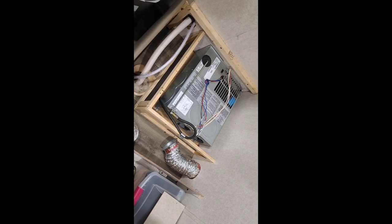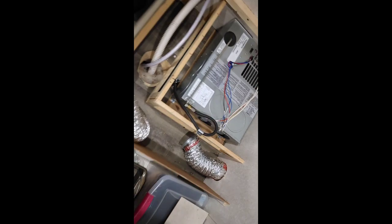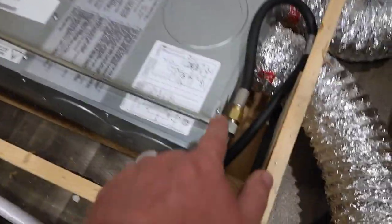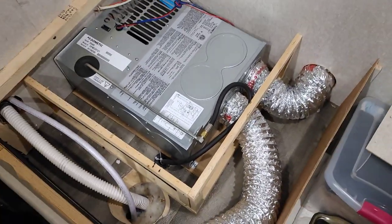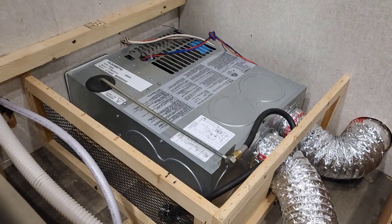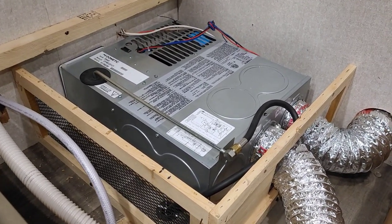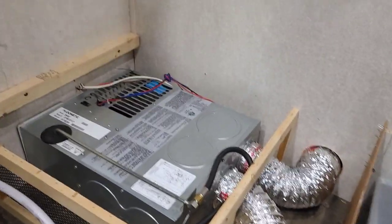Fan kicked on — sounds like it just ignited. Make sure it's blowing warm air. I got everything put back together: put the screw back in the propane line, put both the ducts on with both of the set screws. I'll show you what you have to take off on the outside and put back on once you're done. She's blowing hot.